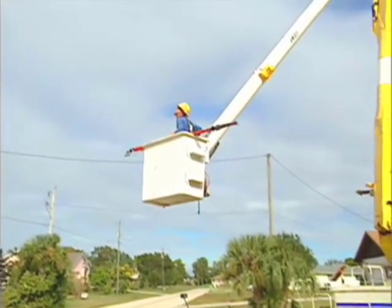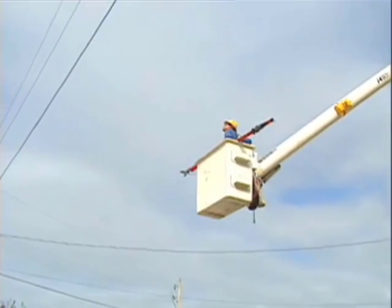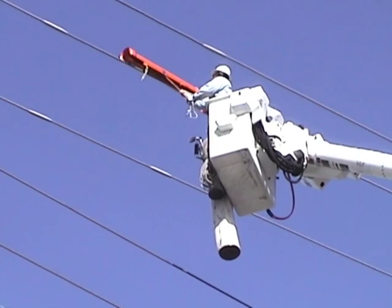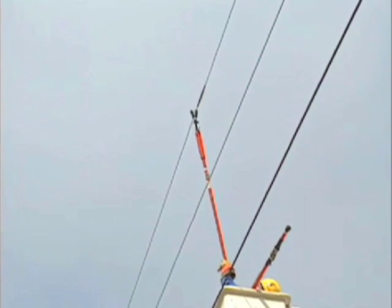Wearing the proper safety gear, move into position and install any necessary safety rubber in place. Then, as is required of any high integrity connector installation, prepare the conductor to receive the ClamStar by scratch brushing to remove residue which has built up over time and to roughen the surface of the conductor.